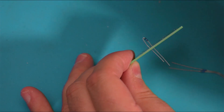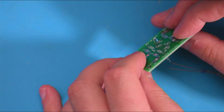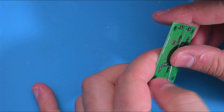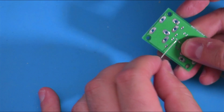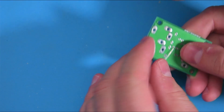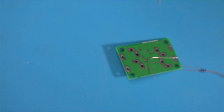You could see the resistor sticking out of the board a little bit — if you shake it, it could come out more. So what we want to do is push with one side so the resistor is being pushed into the board, then take the legs and bend them away from each other. I'm going to move this leg over here because when we're soldering, if a leg was going over another point that gets soldered, we might accidentally get solder somewhere it's not supposed to be. Now let's solder that joint.